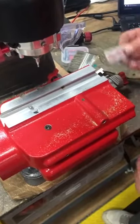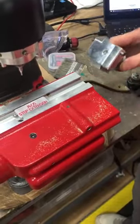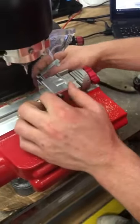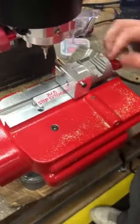We're going to put our jaw four / jaw five stop extension in the dovetail. As you can see, the jaw has a similar dovetail to the profile of the table, so it should just slide on until it hits the extension post. Tighten it in place and then go ahead and close the jaw.